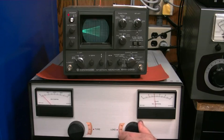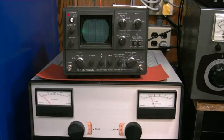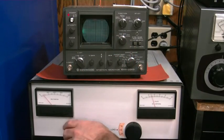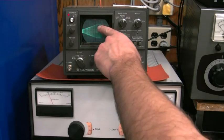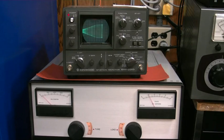So we need to lighten up the loading just a bit. We're seeing that we need to lighten the loading because there's a little bit of a trombone shape there — got it dipping in the center. Lighten up just a little more. And I'm going to exaggerate it with too light loading — and you can see that it's flat topping there. So we've gone from a trombone shape to a flat top there.